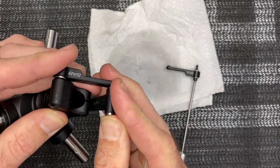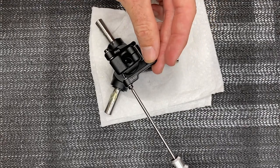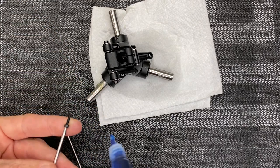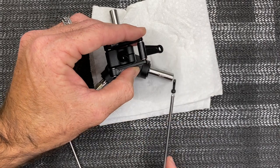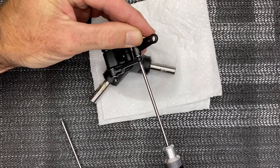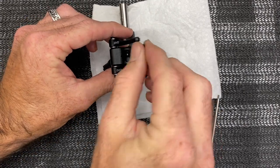It can be a little tricky getting that bearing into place. Once popped in, grab the arm and assemble — lipped side faces the flanged bearing. Get it started, almost all the way down. Then grab a 2mm driver with Loctite on the screw — put a bead of Loctite, let it run. Before tightening, slide the screw through here — it goes through the bearing into the hex nut on the other side. Tighten down, check that it's still free. Tighten fully, SAB facing out, then finish with the 2.5mm driver. Free and smooth is what you want.